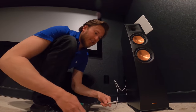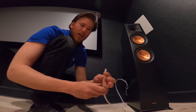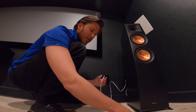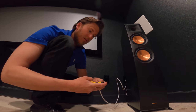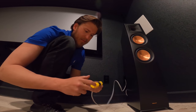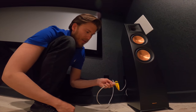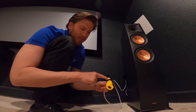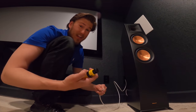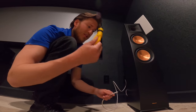We're going to start fresh just so you guys know exactly how to do it. This is an RG6 cable — typically this is what you'll see from your builder or if you run one yourself. You're going to take this stripping tool I just showed you at Home Depot and line it up. They have a little diagram right here on the front. You close the lid so it lines up perfectly, then spin it. Mine's kind of old so I did it three or four times, but you should only have to do it once or twice with a new one.